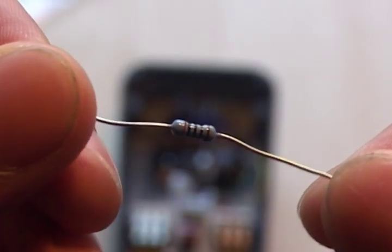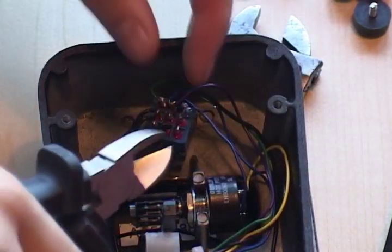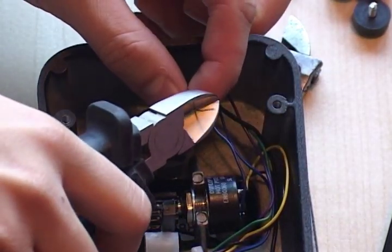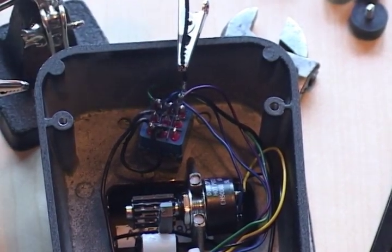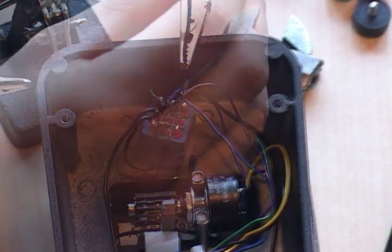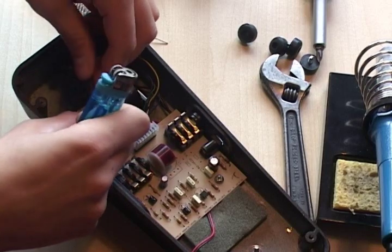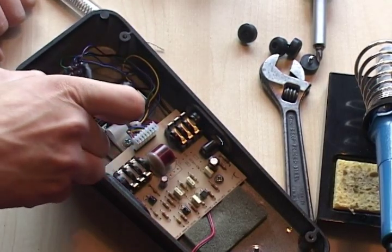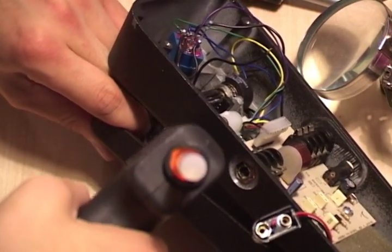Now get your LED holder and pop it over the LED and push it into the side of the pedal. Now get your 2K resistor and solder it onto the switch onto the middle right terminal. Snip off any excess wire off of the resistor before soldering. Now solder the first wire we added to the LED — from the cathode or short leg — onto the resistor on the switch. Slide the heat shrink we added earlier down over the exposed metal and resistor just above the switch, and then heat it up to shrink it. You can, if you want, glue the back of the LED to secure it inside the pedal.